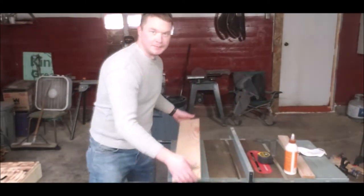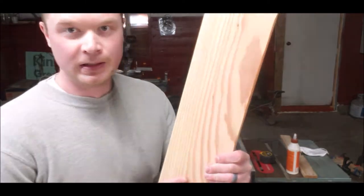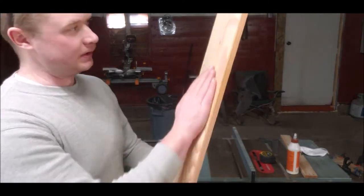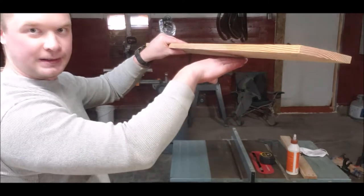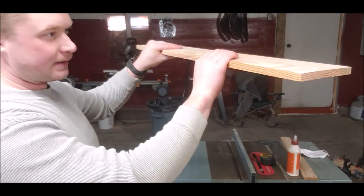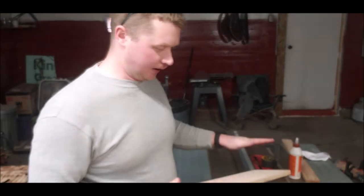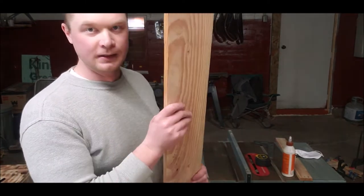I got these other pieces of pallet wood, all sanded up off that same board — this is just pallet wood, look how nice that is. Did it with a belt sander with 80, really got into it, then went up to 150. It's nice and smooth. This will be the top that will sit on the key rack or coat rack — whatever this is going to be — and then we're going to have some sides that come down. I'm going to go ahead and burnish it. I still have some cutting and routing to do, but I want to burn it and see how that goes.